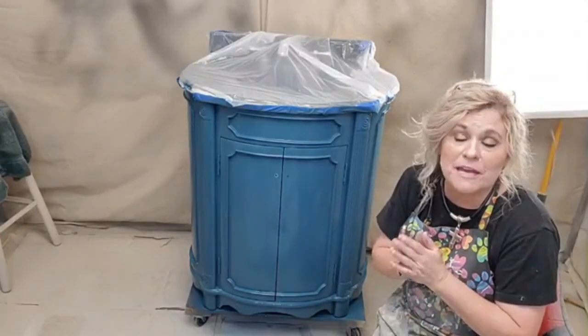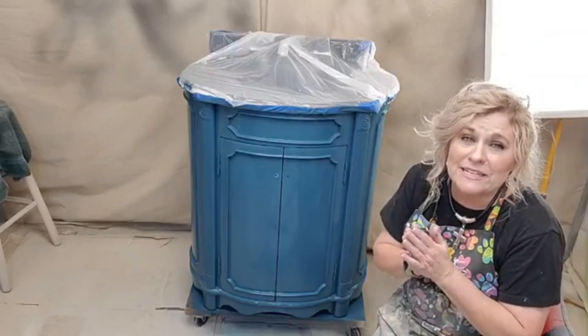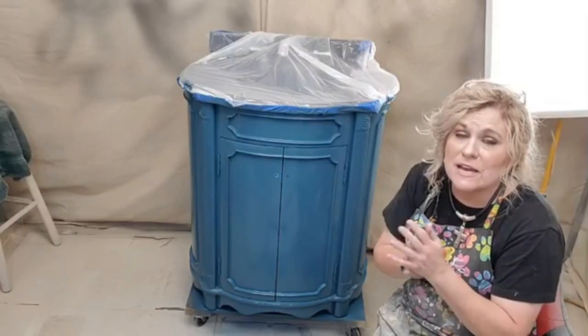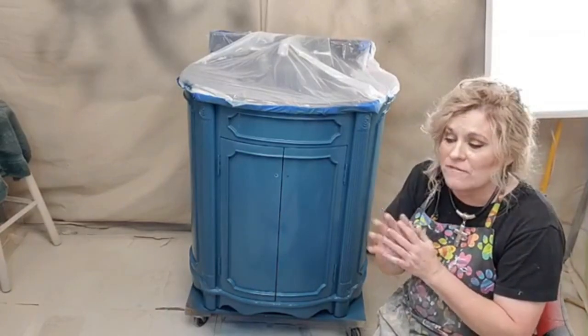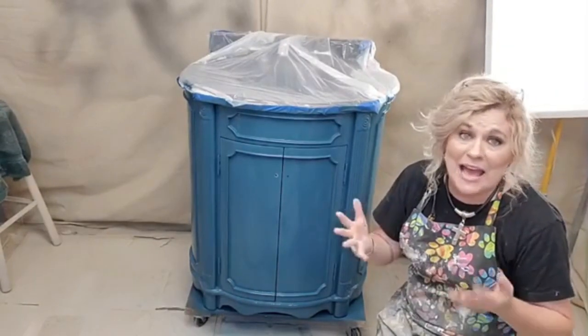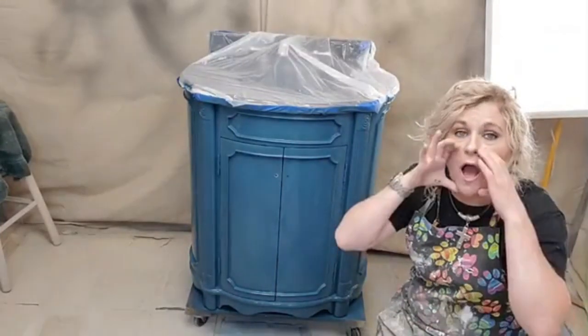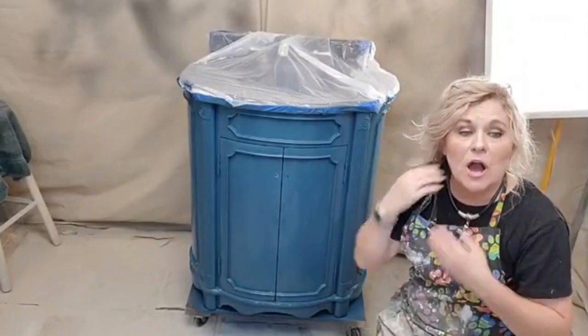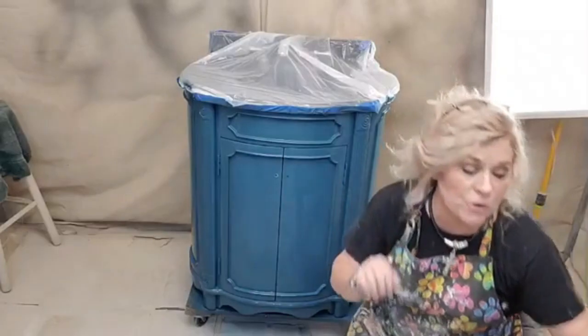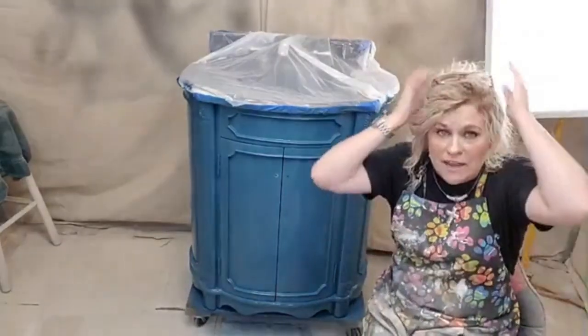If you're going to do your kitchen cabinets or something like that, I would at least spend the $300 for the Airless, because I'm telling you, the difference is night and day. I have several of the sprayers. I demonstrated a couple of the others last night, and it really makes a big difference. I don't care what kind of sprayer you're using, always protect your breathing. Always, always, always wear a mask. If you have sensitive skin, be sure and wear gloves. Most people wear glasses, and typically I wear my glasses. I don't wear safety glasses. I just wear my glasses.